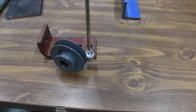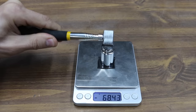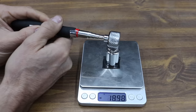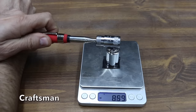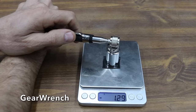If you're trying to pick up a runaway nut or bolt, an unshielded magnet can make things challenging. In the shielding test, the Pittsburgh struggled at 68.43 grams of bleed-through. The N-Bar really struggled at almost 259 grams. The Cap OD performed best yet at about 59 grams. The NoCry needs improvement at almost 110 grams. The Craftsman offers the best shielding at only 14.88 grams. The GearWrench performed best overall at just 1.29 grams.